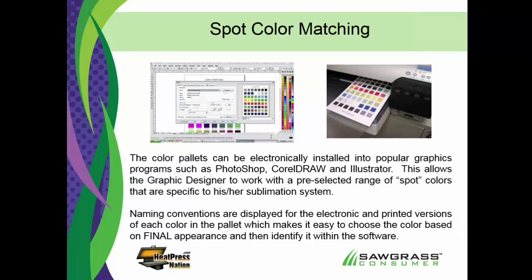Even with all that going on, sometimes it's a little challenging to get exactly the right color. The best way to know what a customer needs is for them to bring you a printout showing the exact colors of what it should be. When somebody gives you a USB memory stick with an image saved as a JPEG with RGB values, it's going to look different on every computer. The best thing is to have the customer provide a printout showing the colors as they should be so you have something you can visually match your output to. Then you can use spot color matching, printing out different color swatches to compare and fine-tune the color.